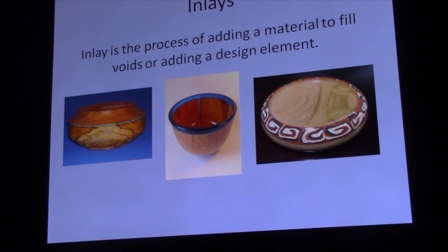The difference between the JB Weld, Mohawk, and Milliput, thank you, is that with the Milliput you have about an hour to work, so you can work with it. The other two, you have about 15 minutes. It'll start getting hot as you mix it, so you have to work fast. You can't have a big volume of it.